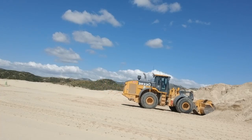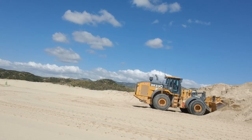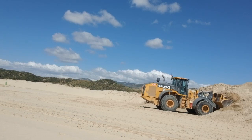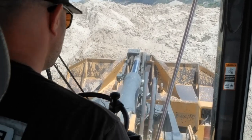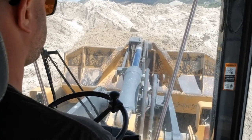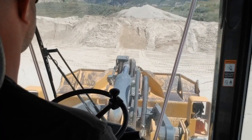We're going to dig into a pile here. Put the bucket down parallel — that one part I showed you at the beginning. Push on the gas, pull up on the right stick towards you, curl up towards you with the left stick, towards you with the right stick, all while pushing the gas and digging into the pile. Then reverse back with your left joystick.